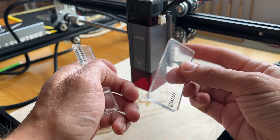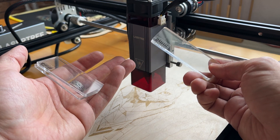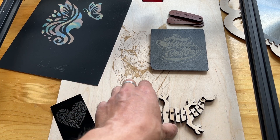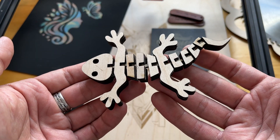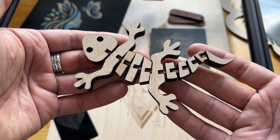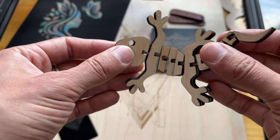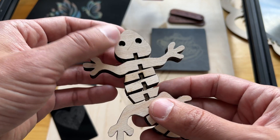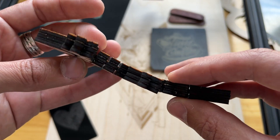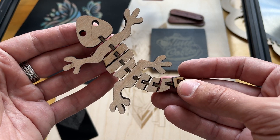The focus indicator is a transparent plastic piece — it's a little inconvenient because you can drop it on the floor and it's hard to spot. For the test engravings I didn't want to do just standard test patterns; I think it's more interesting to engrave something real and show what the engraver is capable of. For example, this is a small layered plywood piece — three layers of plywood. It was done in two passes. I prefer to use lower power and more passes to preserve the laser module's lifespan.